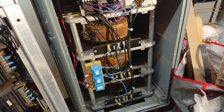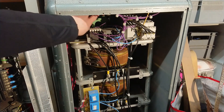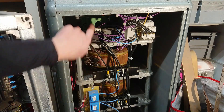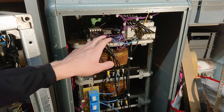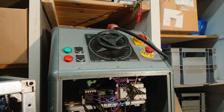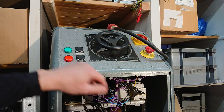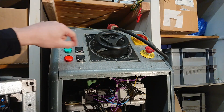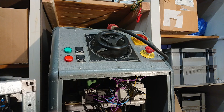I built a lot of extra electronics into this unit. I have some measurement transformers, and some current transformers sitting in there — the blue ones are for voltage, the green ones for current. I put in a little power supply and a mains contactor, and built in a safety feature: it has an emergency stop, a start and stop. You have to actively power it up, and once it loses main power it will not automatically start up again — it will then be stopped.